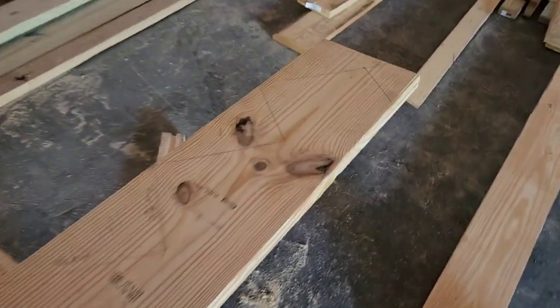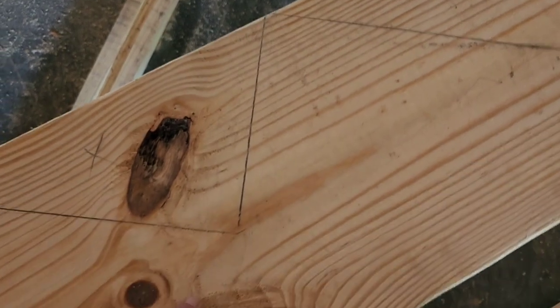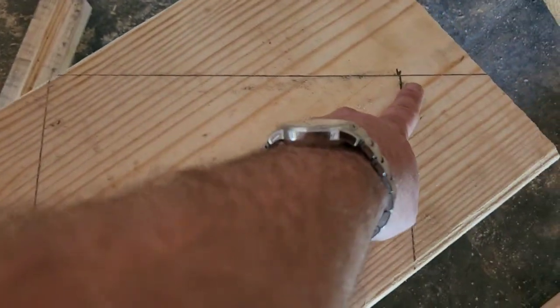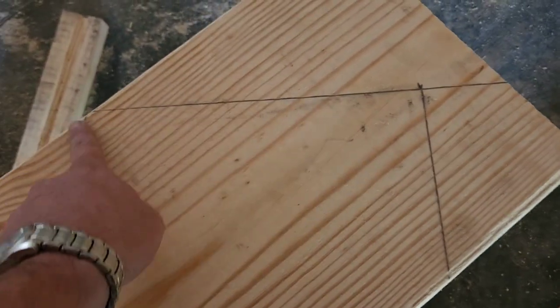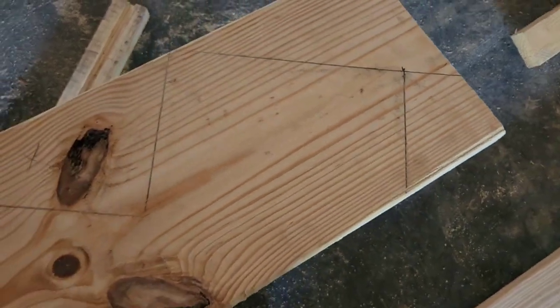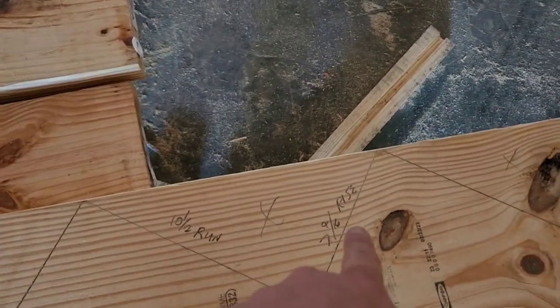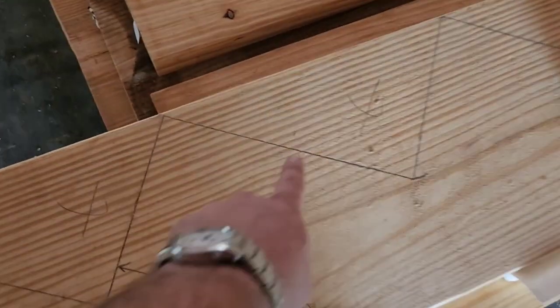Going back to the top — this is my last step, which is going to go against my rim joist. So this is your top step. Now that you've made your marks, you flip it over and make that mark, or just get a square and measure 10.5 inches — which is my run — and make a mark at 90 degrees. That's the edge that will butt against the rim joist. Count each run: we have 1 and work our way all the way to the bottom, to 14, which is the last one.